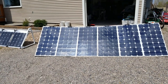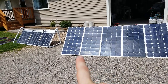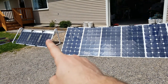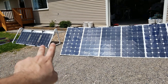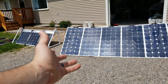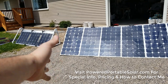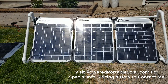The B&D panels work great lying on the ground, though they are lightweight so they'll fly around a bit. Each of these panels weighs four pounds — but this four-pound B&D panel makes 100 watts while the four-pound Predator makes 50 watts, so two Predator panels equal one B&D. That's one advantage of the B&D. The Predator panels are more robust because they have aluminum backing, whereas the B&D panels have UV-proof plastic backing.